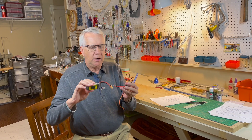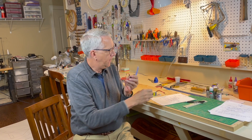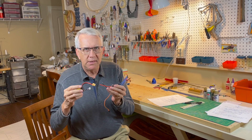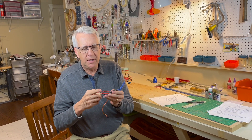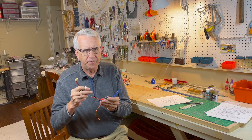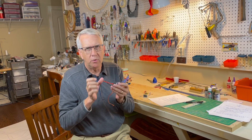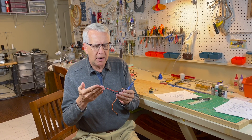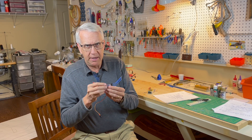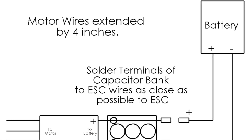First of all, for the battery side, you'll have some sort of connector that you'll have to solder on. The battery side is the side you do not want to extend unless you know exactly what you're doing. These wire lengths combined with the battery are designed to be this specific length because the ESC understands its distance — the electrical power is switching on and off as it gives instructions for the brushless motor to rotate. If the wires are much longer, there'll be delays, the signal won't be interpreted properly, and you'll eventually destroy the ESC over time. If you do wish to extend this side, you could add capacitors, but I wouldn't recommend messing with the battery side.